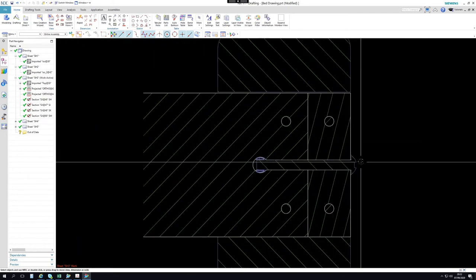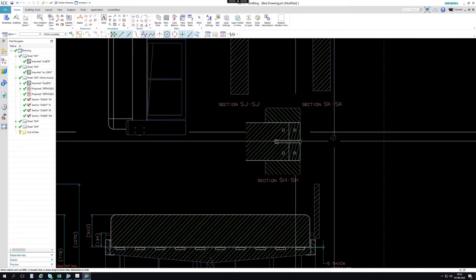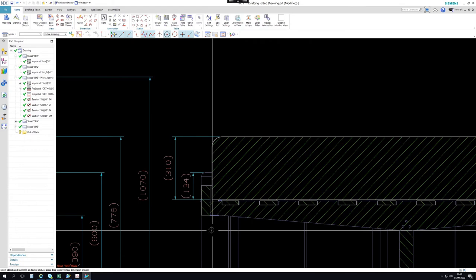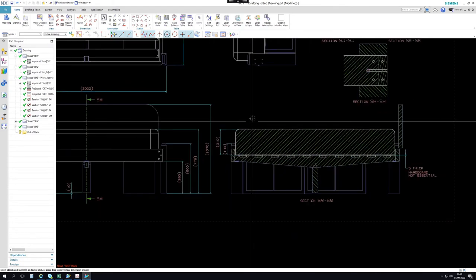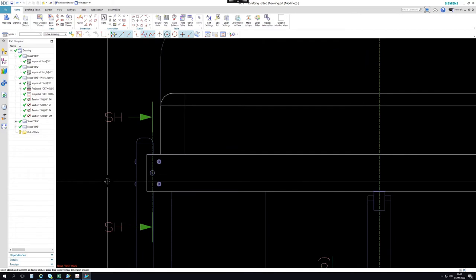And likewise at this location, it goes into the barrel nut. It's a very, very strong joint, this is. And most of the load is actually sitting on the frame, going directly into the outside feet and into the central foot. It's a very, very strong joint. It's probably not quite as good as sort of a mortise and tenon joint, but it's a lot easier to make and it's probably stronger.